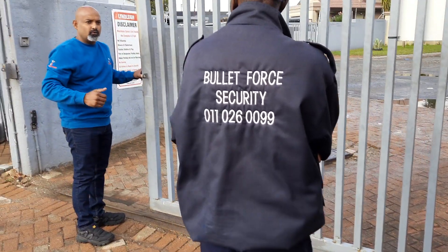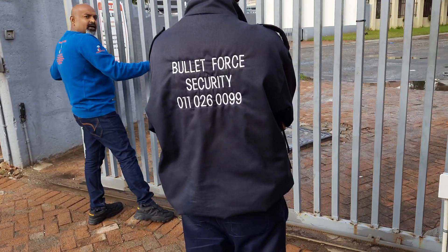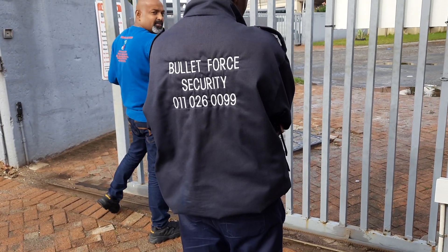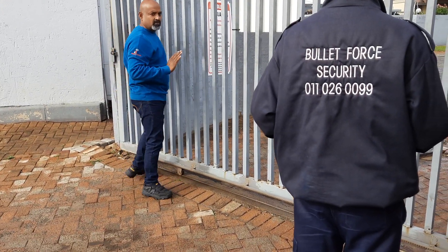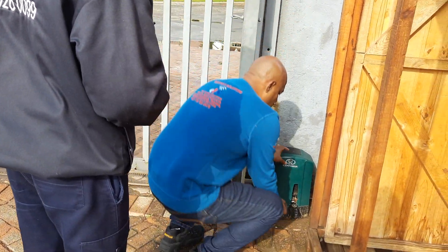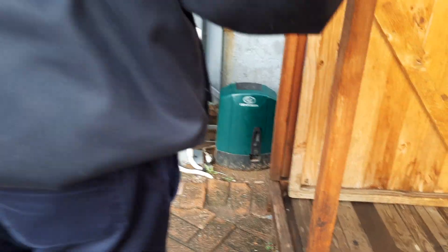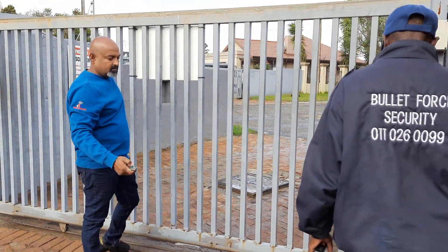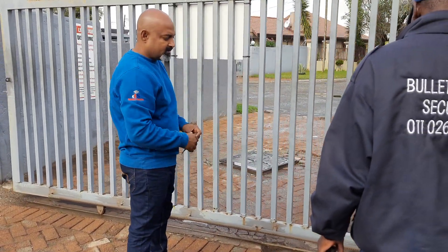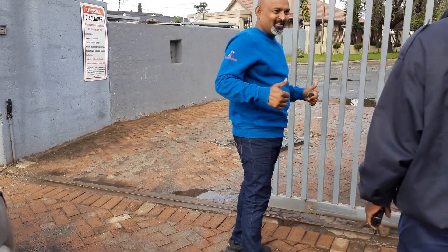Also, when you are closing with your hand, you must tell other guys — other security — that when you're moving it with your hand, you have to move it slow. Not fast like this — moving it fast is going to cause damage. Close it fully. Then you can put it on auto and lock. It needs to be locked all the time. Now you can press the remote — but before you press the remote, you have to move the gate with your hand first. Move slowly. I hope this helps.